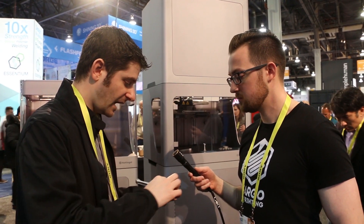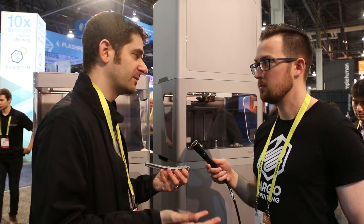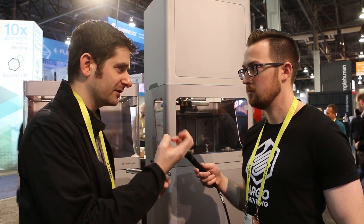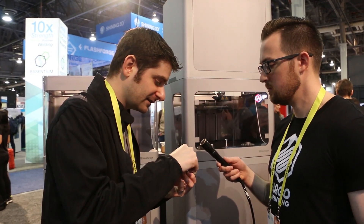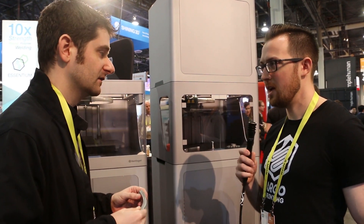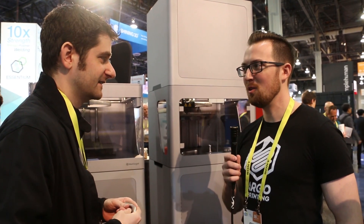Yes — one of the unique things about this process is that this entire brake lever is hollow. We can create a honeycomb pattern and print over it, which you can't do in a powder bed process. In a powder bed, the part would be full of unmelted powder — you'd have the weight but no strength. Because we're depositing material in air, you can make these hollow sections. This one is about 50% air, making it 50% lighter, with less material cost and faster printing.